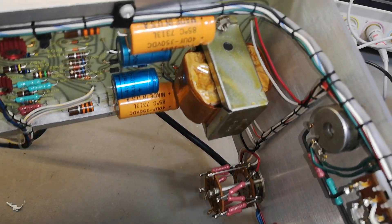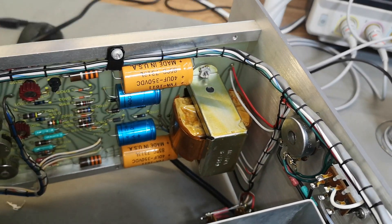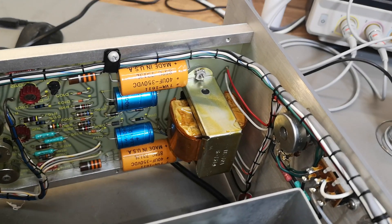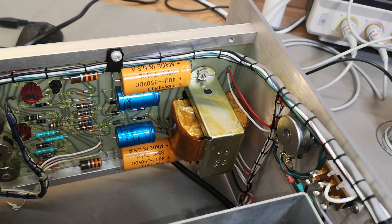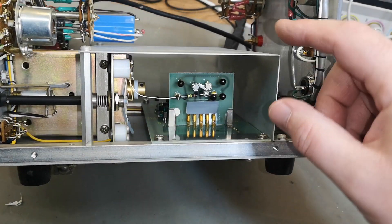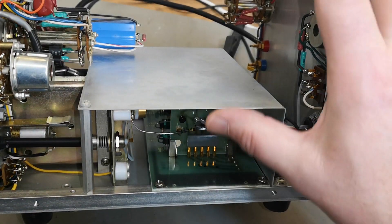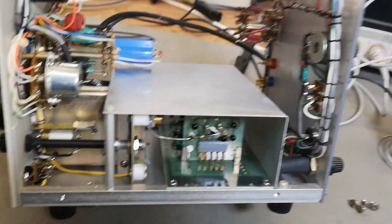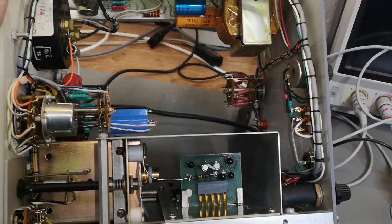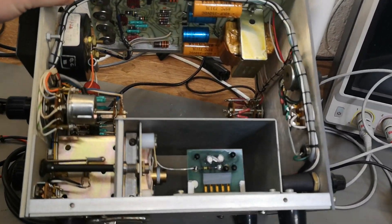The mains transformer is far away from all the input circuitry. That is the output amplifier and the high voltage stuff. All this nano- and pico-level environment is down here. You can shield, but what really works is distance. This is why all this air space is up here - distance is what really works.